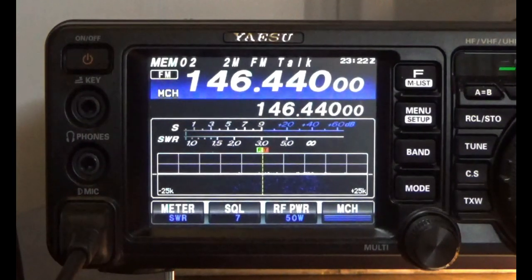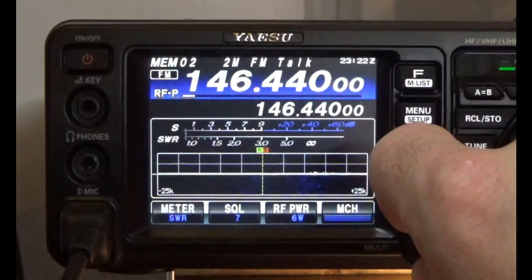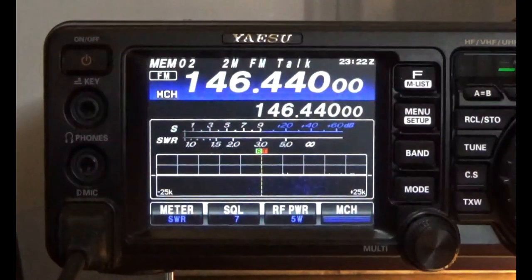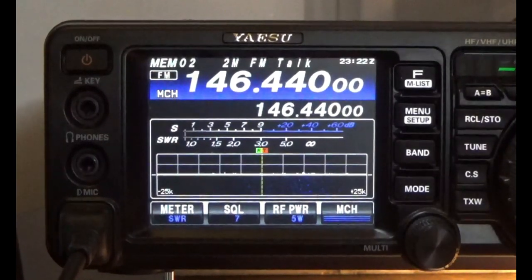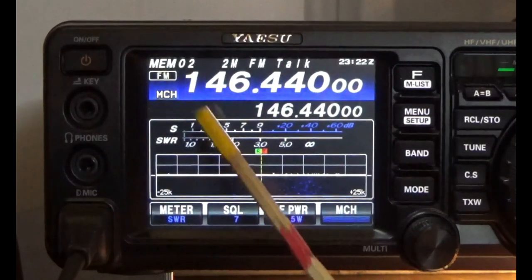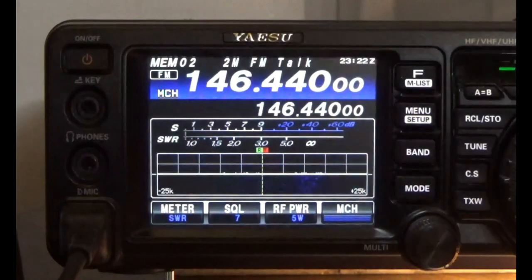What I can't explain is the SWR meter shows good but I'm not losing power and I'm not in the red. Quick demonstration — KI5JUF, right about 1.7 on the external SWR meter, but the radio's meter shows flat lines. Interestingly, if I drop the power the SWR drops quite a bit — even at five watts it's almost flat lined. Main things to watch: make sure the needle isn't falling back, and on SWR if it gets over 2 and goes red it'll immediately cut your power back. 73 and have a good day, thanks for watching.